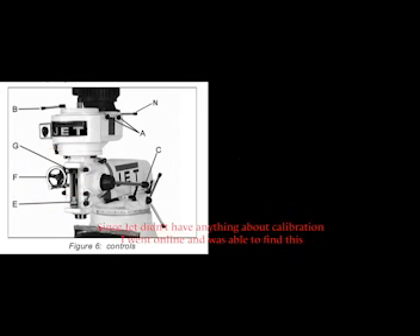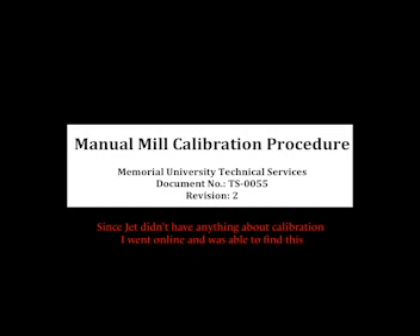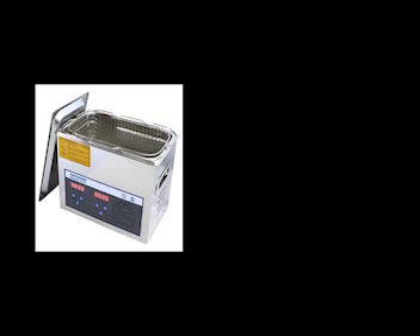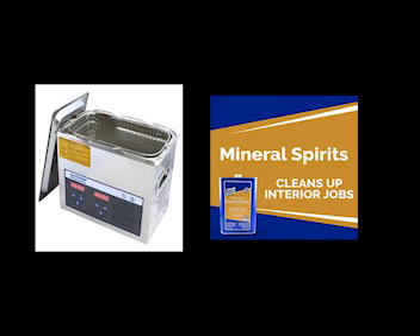If you wish to calibrate the system yourself, proceed as follows. Standards and equipment require that you must have a calibrated dial indicator and a calibrated finger dial. Additionally, all standards and equipment used must have a valid calibration certificate. You will clean both the dial and finger indicators, measuring surfaces, stand, the mill bed, spindle, and all mounting points for the magnetic base.